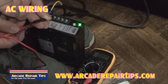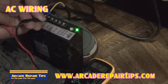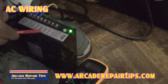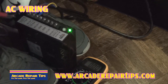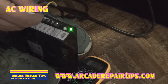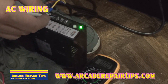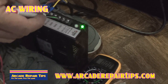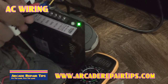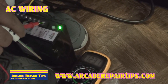the 5 volts, it says +5 is right here, and we're at 5.2. So we are a little bit high. We're going to adjust that down. Now we're not going to use the -5 on here. If you want to, you could make a mark on that one that one is not going to be used, or you could just take that screw out to make sure you don't hook up something wrong. But for right now, we're going to be checking our 5 volts. It's more important that we get the 5 volts in than it is the 12 at this point. But if we read our 12 volts, we'll notice it's also kind of high.